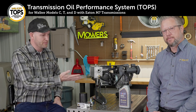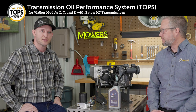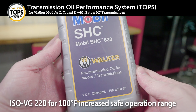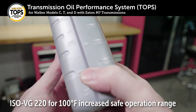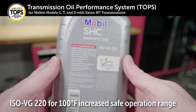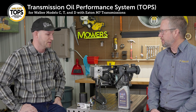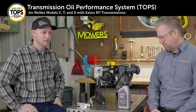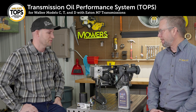Many of you are hopefully familiar with the new Mobil SHC 630 oil that we've been recommending now for about the last six months. This oil is recommended in tractors that don't have TOPS, but it will also be the oil we recommend with the TOPS system. This oil has more viscosity — it's a higher viscosity so it's thicker when it's cold, but it's also a very high viscosity index oil, which means it stays thicker to a higher temperature, providing the protection we need at elevated temperatures. It's also an extremely high quality, fully synthetic oil that's already proving to be a really nice benefit from a longevity and durability standpoint.